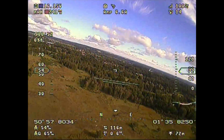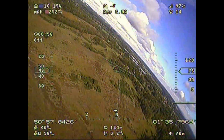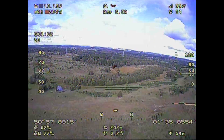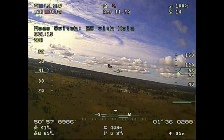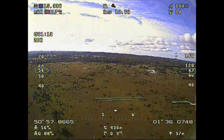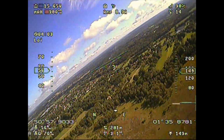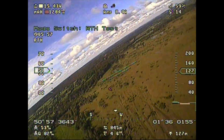Really happy with the Vector — I tested out all the modes I put in and they worked well. For the launch initially I've got all the autopilot aids off, then we changed to normal stabilisation as my first mode, 2D stabilise with hold for my next. I also had loiter mode which worked well, and of course RTH which I'm testing here.